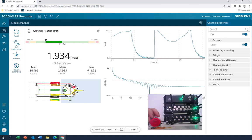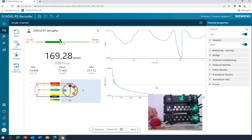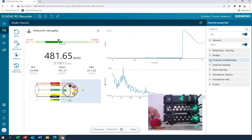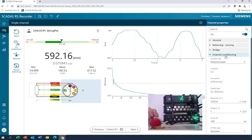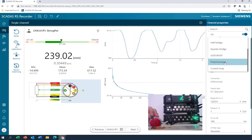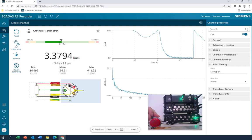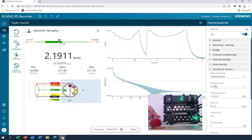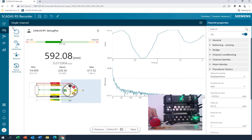So what have we got here? It looks like there's a level bar in the top left, a time trace in the top right, and it's showing data in real time, frequency down below, and a wiring diagram, so you know how to hook that string pot into the first channel. Very nice — that makes hooking up the sensor much easier. It's always nice to see the pinouts in front of you. Here's channel conditioning, where I picked potentiometer. Pot and string pot is short for potentiometer. I set the voltage supply, point identities where you can name your channel, and transducer factors with the engineering unit.